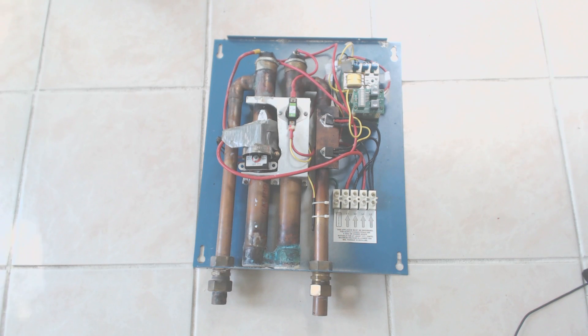The SETS unit was bought new in January 2005. It suffered a TRIAC failure in November 2009, which I repaired myself by ordering a $5 part from Digi-Key. The brand new EchoSmart unit was installed in March 2014, and I've had no trouble with it since. You might ask why I'd consider the EchoSmart given I got only about four years of trouble-free use from the SETS unit. In fact, I repaired the SETS and ran it from 2005 to 2014. Since the electrical and piping were completely installed and the two units were virtually identical, it made sense to simply swap the unit out.